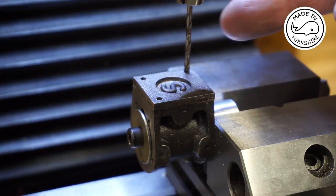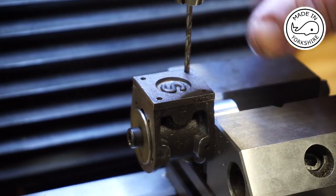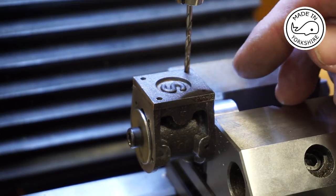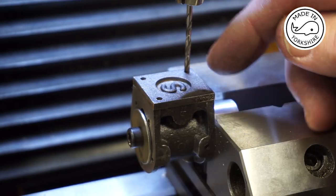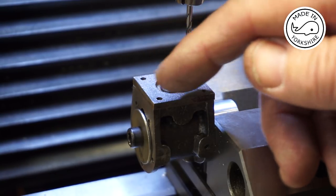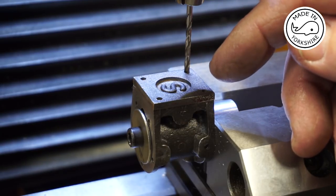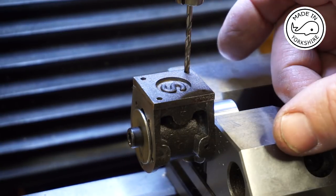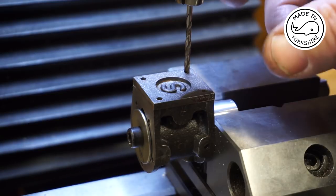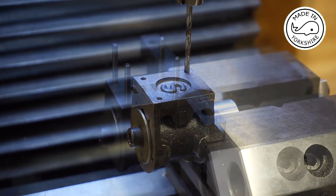So what I'll do is I'll replace the drill bit with the centre drill. I'll just hand turn it, make a mark, then I'll move the dials across. I've zeroed the dials, by the way, at that position. Now I'll move the dials across in the same way as I did the cover and the chest. Just marking. I'll double check, then I'll centre drill properly, then I'll drill to 2.1mm in diameter, and then I'll tap. But I'll do all that off camera.